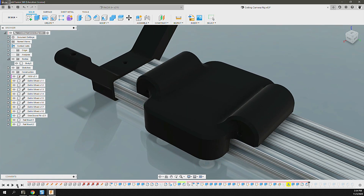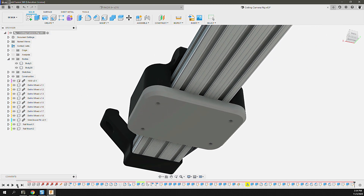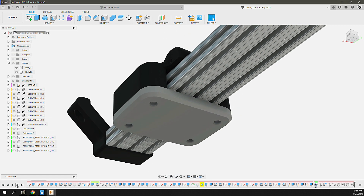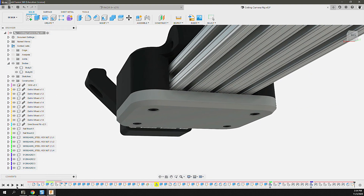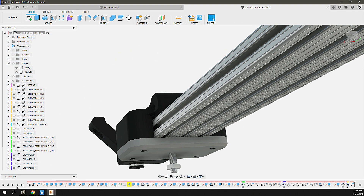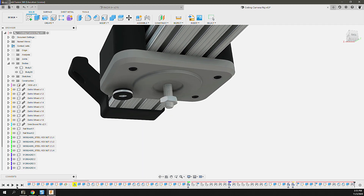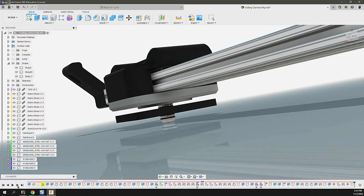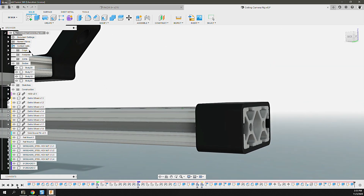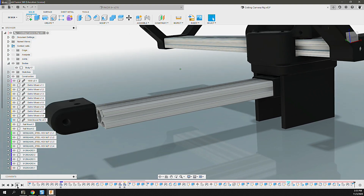The body was designed around these wheel placements. The top wheels would use 5mm dowel pins as retainers, while the side wheels would use 50mm M5 bolts as their axle. These M5 bolts would also hold the face to the slider, which is the primary load-bearing part. On the slider face I incorporated an M10 elevator bolt to serve as the rotational axis for the arm. The arm mounts on this elevator bolt, sandwiched between two thrust bearings with a large nut and thread-lock holding it all together. For the arms I designed an end cap mounted on each piece of extrusion, providing a pivot hole for the M8 bolts which I used to hold them all together.